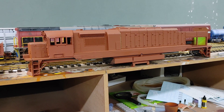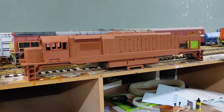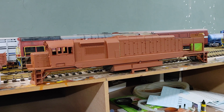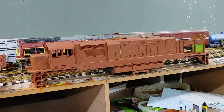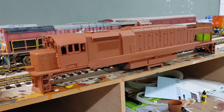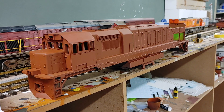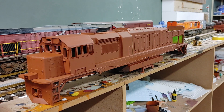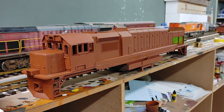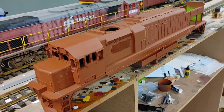I understand what he's saying because it's a lot of work to actually get this body to that sort of level. Now, the problem with resin is it hates sunlight. You can't print this body in resin — you just can't. Because UV resin, once it's set and all, it's all good and well. But if it stands outside in the sun by the club and that body gets to like 60 degrees surface temperature, you will bend that resin. I can guarantee you, you will. Because we printed a piece that I left on my wall at the house about two years ago and that thing warped massively. You cannot do resin for outside trains. Forget it.